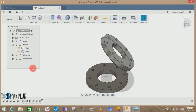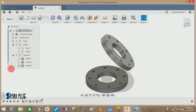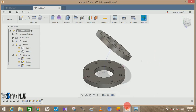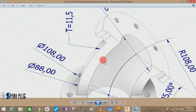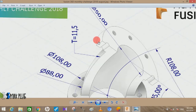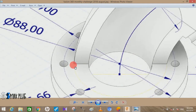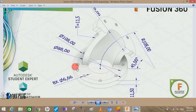About 90% of the work is completed. Hide the sketch or keep it visible as needed. We now have to create a sweep along the arc path we created. The thickness of the flange at the center point of the pipe is given as 11.5 mm — that means the distance between the inner circle and the outer edge of the flange is 11.5 mm.